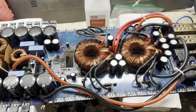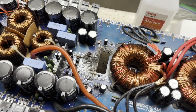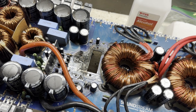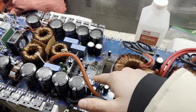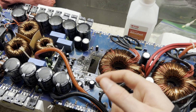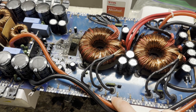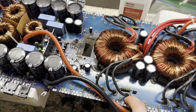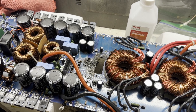I think that check mark might have been from a prior repair. I did the same isopropyl alcohol cleaning around the damaged area. I also removed the coil — or inductor — right here. I had to use a box cutter to get whatever adhesive was holding it, and I ended up using the soldering iron to melt it a little bit and the box cutter to pry it off.